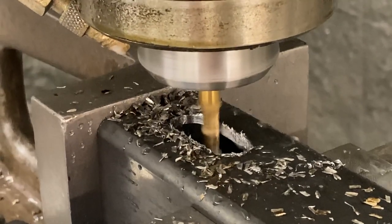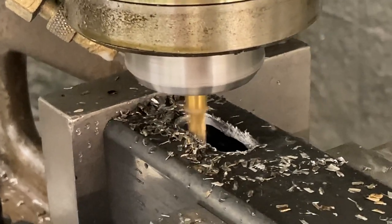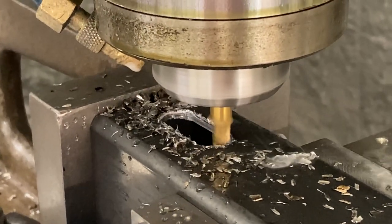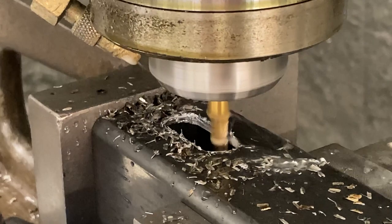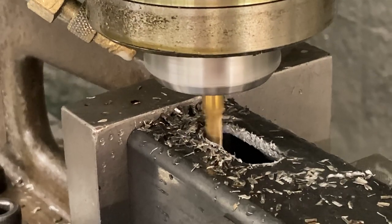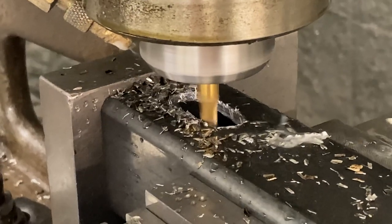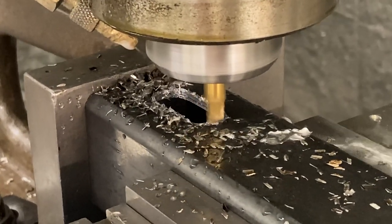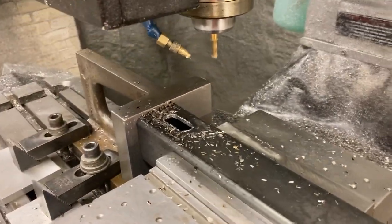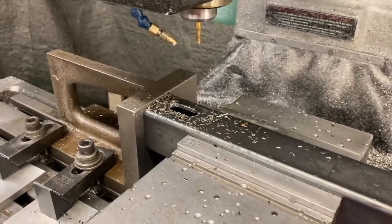That's a semi-finished pass or a spring cut. Basically, it's back on the same pass that it left off on during the rough cut. And I think I got a 3 or 4 thousandths finished pass, so that's what it's doing now. So that's it for that. It's out of the way. Turn the coolant off and blow the chips out of the way. Take it out, rinse and repeat, put a new one in.